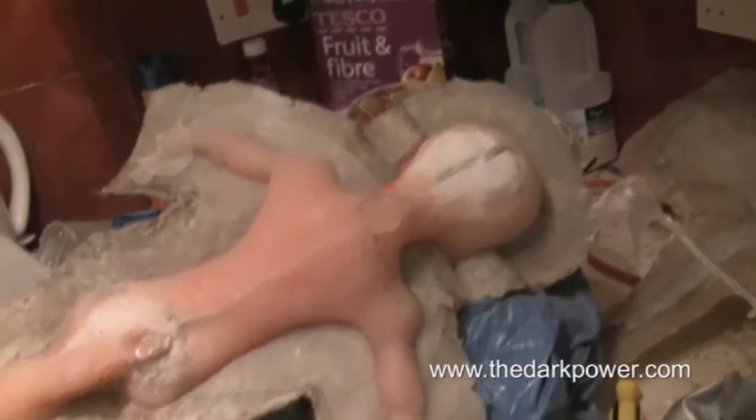So we've just cracked the mould open. So far it's looking quite good — the back of the head. The silicone doesn't appear to have covered the foam core; it's not entirely a problem so we can just cast a small section of the back of the head and then glue that on. I'm going to now try and pull the rest of it out and hopefully the front of the mould will be fine.